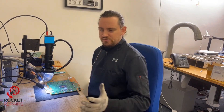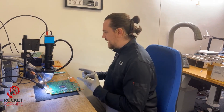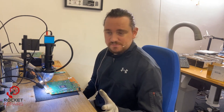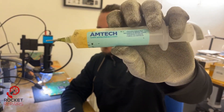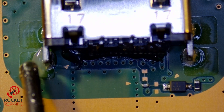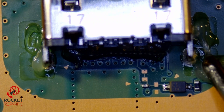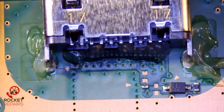I'm currently looking around for my flux — my flux has disappeared, gone missing. Somebody else did work here on the weekend so I don't know if they've taken it, or I'm just being blind — probably the latter. For those interested, we actually use Amtec flux. So we're going to apply a generous amount of flux because we're going to add leaded solder onto the board, because that lowers the melting temperature of the unleaded solder that's already on here.